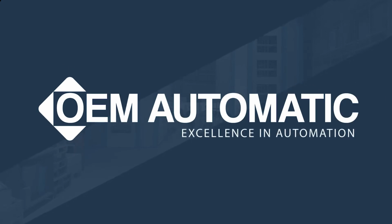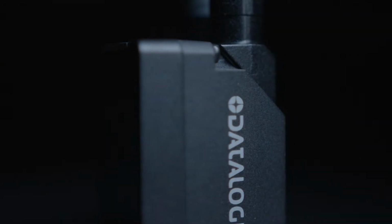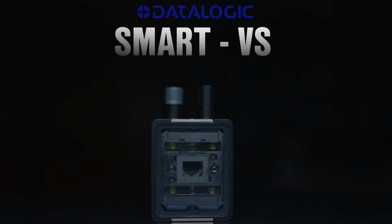Today I'll be introducing to you the Smart-VS Sensor from Datalogic. The Smart-VS is a sensor that sits between a standard photo sensor and a simple vision sensor. The sensor can be used for applications where you want to carry out simple presence and orientation checks. Typically, the sensor is connected to a PLC and gives feedback to the machine control system.